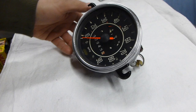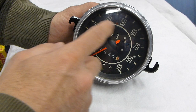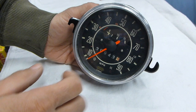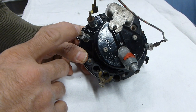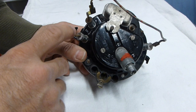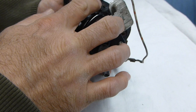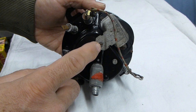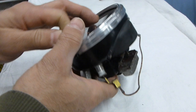On this style of speedometer you've got a couple of different parts. We've got the glass in the front with the trim ring around it, which we'll have to separate from the housing. There's a lower section for warning lights, illumination lights in the back - some are still in here, some are removed. In the front you'll see there's one lamp for the high beam indicator; these others are just the backlight for nighttime illumination.